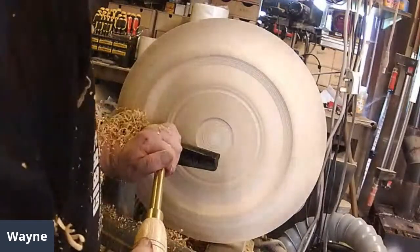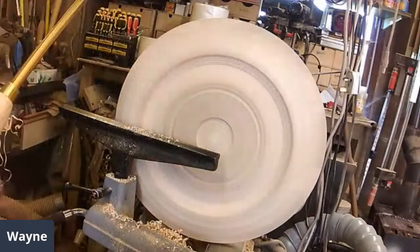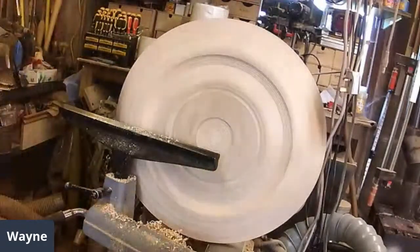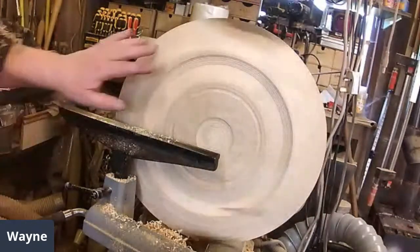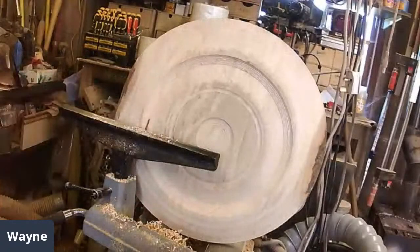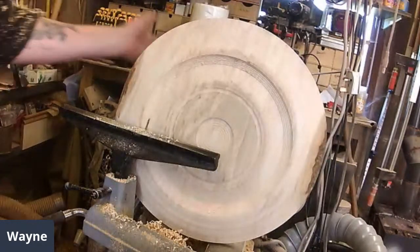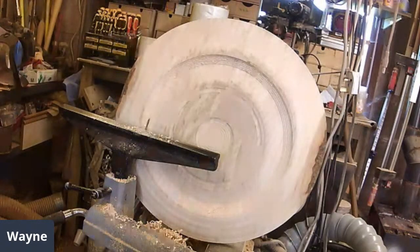John Hayes asks, Wayne, what's the largest piece you can turn on your lathe? On that lathe, I think he's talking about. Right, on this lathe, I can turn just under 16-inch diameter over the bed bars. I have got an extension on this, and the extension does drop down lower at the tailstock end, so I can actually bring the headstock all the way along, and that way I can turn a 20-inch bowl on this one. On my other lathe, the VB36, I can turn...